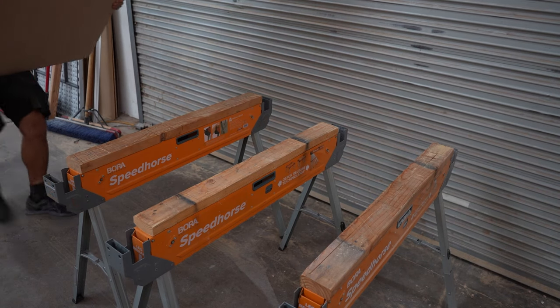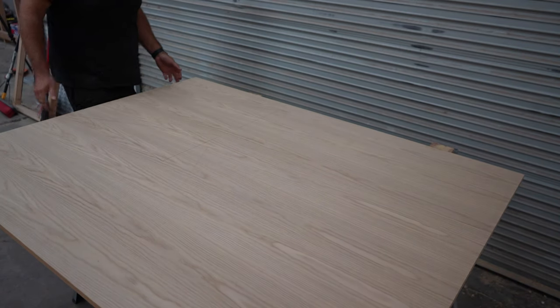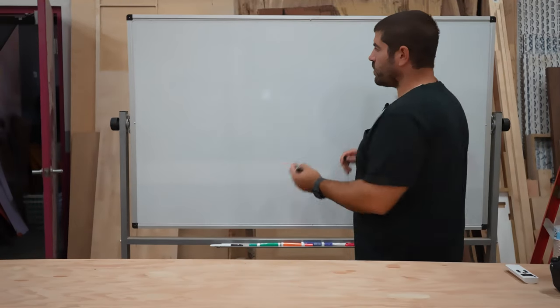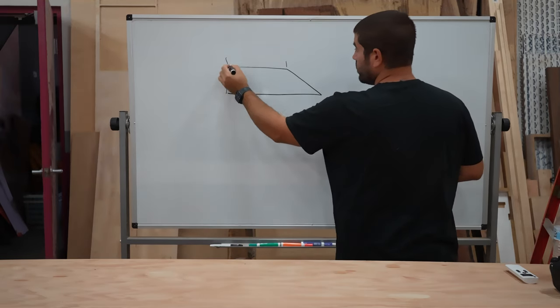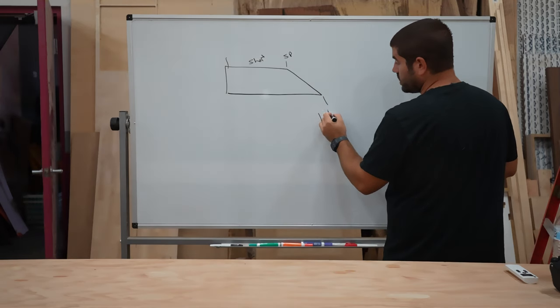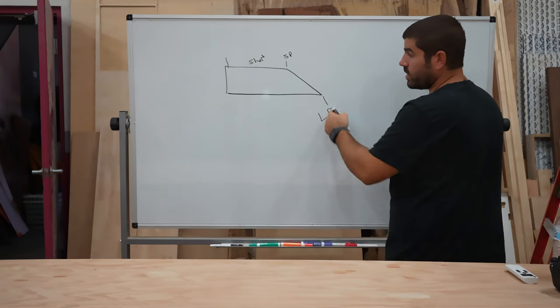This table actually uses a very small amount of wood, so I used scrap pieces of white oak MDF plywood I had lying around. Each of the two pieces have different angles and I need to cut that first on the plywood and then line up the template to the short point of that cut and then trace them. I want to pause here to explain what I mean by short point. So if you have a board and you have an angle like this, this part here being short is the short point. Conversely, this is the long point.